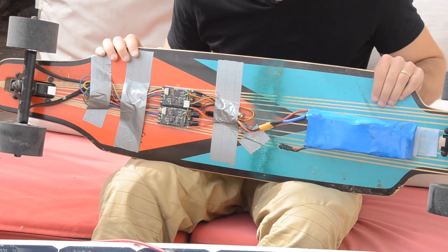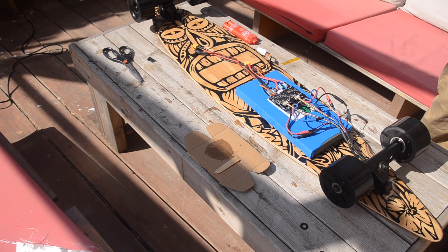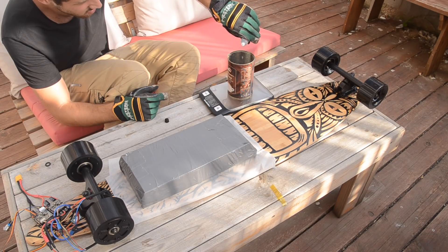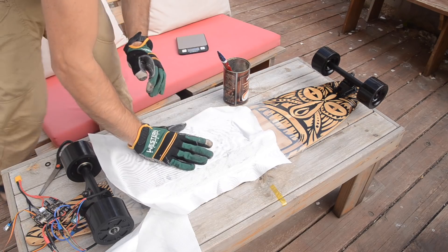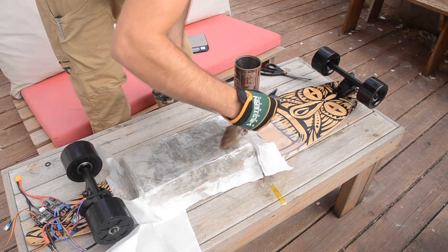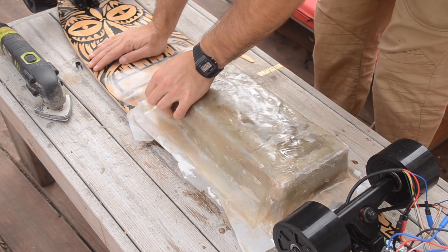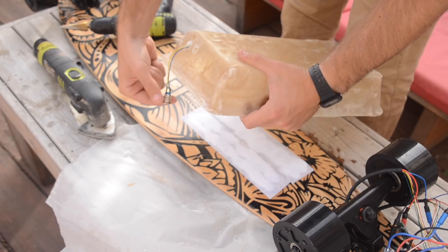However, the components are still exposed, so you wouldn't want to go riding in the middle of a thunderstorm. To make this look nicer and to seal off all the components, I'm going to make a fiberglass enclosure for the board. I made a video all about making fiberglass enclosures before, so I won't go into too much detail, but basically I started by laying down some wax paper on my board under a wooden mold covered in duct tape and rubbed with wax to make it come out of the fiberglass easier. Then I mixed up my resin and laid down a series of layers of resin and fiberglass cloth, each on top of each other. After the fiberglass had hardened, I sanded it smooth and pulled the mold out, then cut the edges back and drilled holes for my wires, my on-off button, and the charging port, and made sure that they all fit.